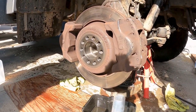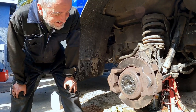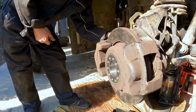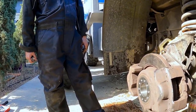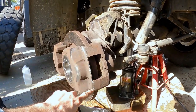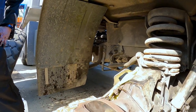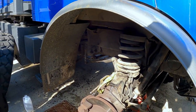I wonder what's next. I have a horrible feeling we may end up having to take the calipers off - I really don't want to. So brake pads are out. Dan had been told that the brake rotor would probably just drop right out and we could leave the calipers in place, but we don't think that's the case any longer. We don't have access to that info, so we are going to take the front part of these calipers off - there are two bolts here and two bolts here. When we break them apart we're going to have oil dripping, so we have clamped the brake line at a rubber hose right there to minimize the amount we're going to lose so we don't have to refill the entire system.